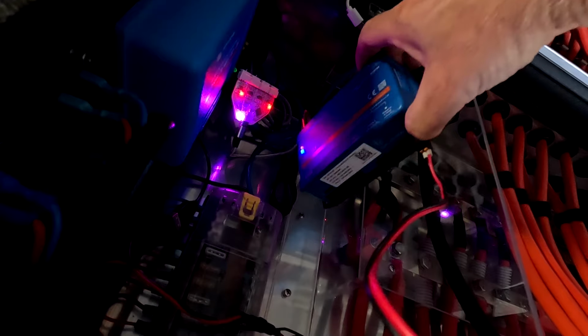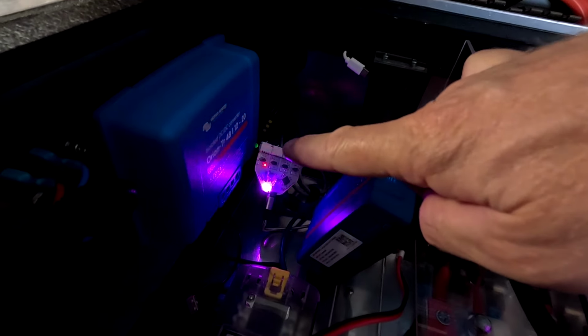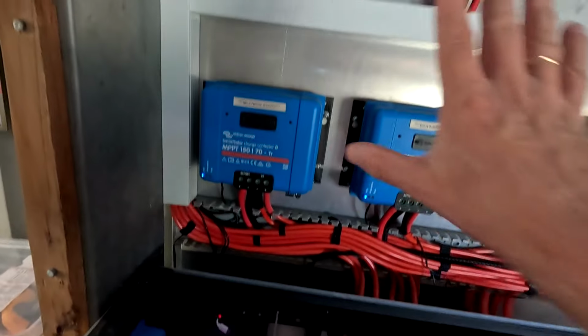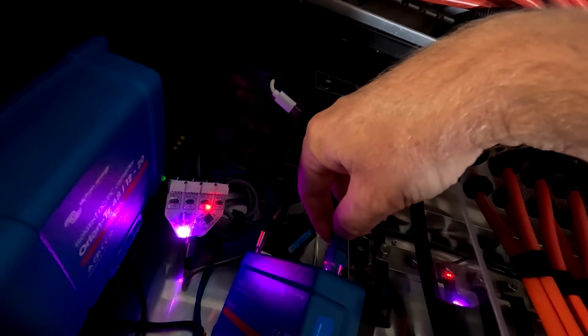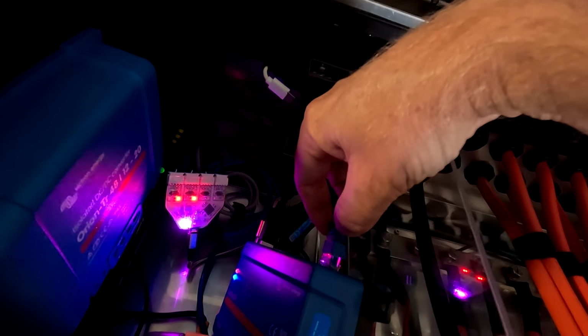Yeah, and we have now the Cerbo GX living in the battery shelf here. The cabling looks a bit wild. But it was like after 12 o'clock last night when I did all this here, because it needs a 12-volt power supply. So I had to connect it here to the fuse holder, and I just left it sitting in here to see if everything works. Which it does. It's a plug-and-play system. I plugged in my 4-port UR2 USB-C controller again, started flashing, communicating with all the MPPTs. Connected the smart shunt via VE direct cable, and also plugged in the multi-plus directly via VE bus now.